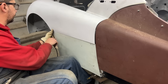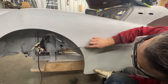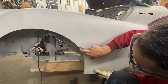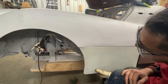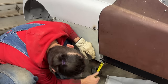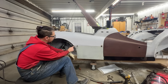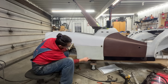I'm going to tuck it and then deal with this curve - I'll have to add a little bit of weld here to extend it and fill this up gradually. Because there's a rolled edge inside we'll have to fix that too. I was thinking if we had cut this a little bit lower that would have brought the curve closer. What we're going to do is not tap it on the side - I'm just going to tuck it and pre-fit the outer seal so we can see how this line is going to match.